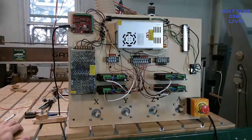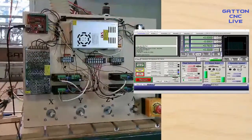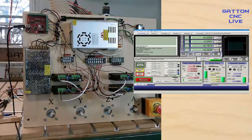But now that I've got this on, basically the setup I have, if I show you my Mach 3 here, I got to click in this thing here. There we go. So there's the X. You'll notice when I do the Y and the A move, and of course the Z. Also notice, I'm going to move the X to the right, and if I stop and quickly try to go to the left, I've got my finger mashing the button right now for the left. It won't go. You have to stop, then hit the second. It doesn't like when you try to do it too fast, which was something very odd to me